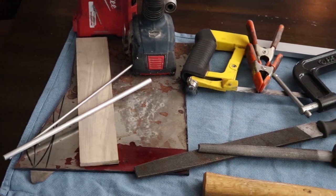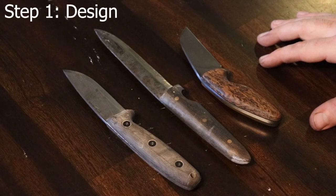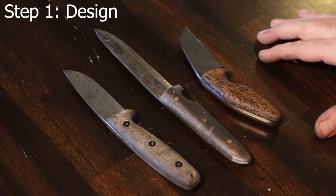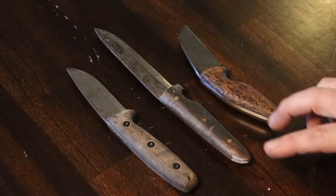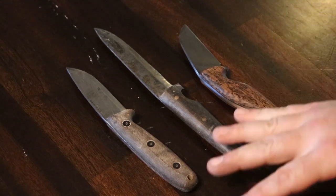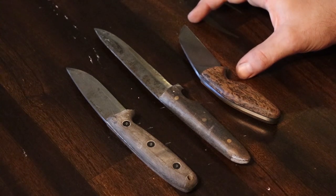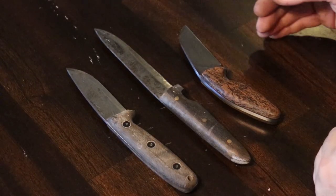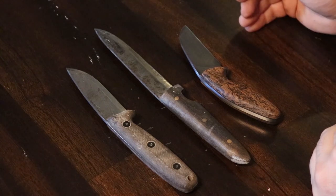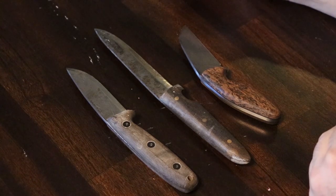Now I will make a knife using only these very basic tools. Before heading to the garage, I need to design this knife. I have three example pieces here — two of which I made and one was a gift from my boss. These blade profiles and sizes are all pretty appropriate for making a knife with simple tools. What you don't want to do on your first build is make a huge knife or one with complicated designs or a really wacky profile. Keep things fairly straightforward.